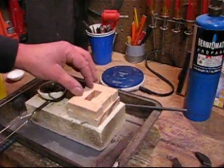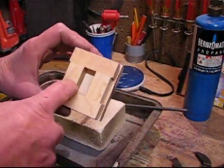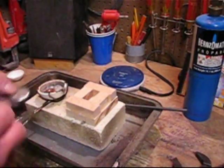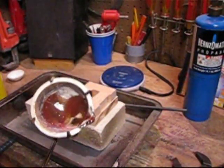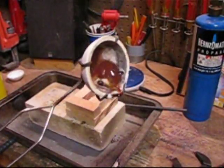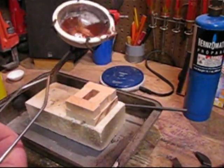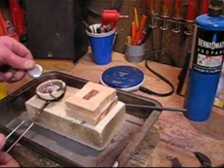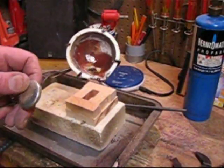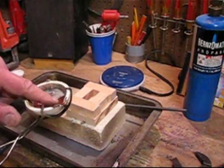So I cut these pieces, I glued it down — I'm making a three-quarter by an inch-and-a-half ingot. Here's my crucible, or you could call it my melting dish — silica fused ceramic. The junk that's in there already is some borax and some impurities, but they tend to stick to the bottom and be drawn out of the silver.